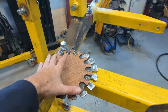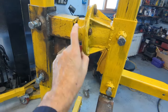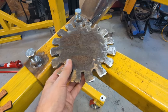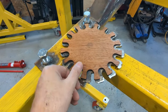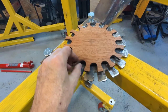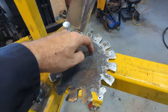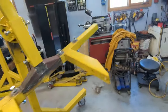What I have for the other end: that was the flange I welded on right here, and that's the flange of the hub. So I made this flange up — that right there will be replaced on the other end with this piece I cut out of the plasma cutter. It needs cleanup still — she's rough. My plasma cutter has a hard job cutting three eighths inch. My wife made me a nice template for it and it stayed pretty good, considering the amount of time it took to burn through. For the other end, I'll cut out the hole for the hub and then put the bolts in. She's looking pretty good — swings smooth, everything's tight.